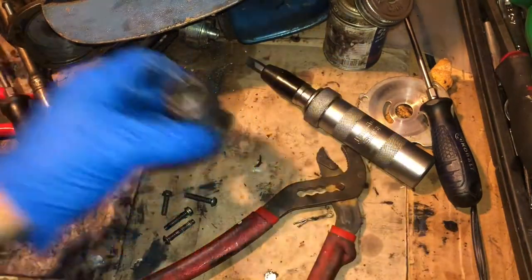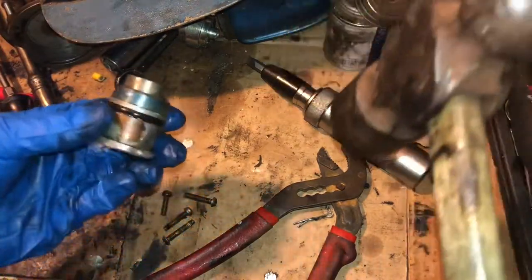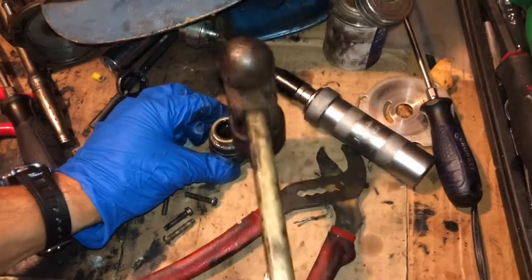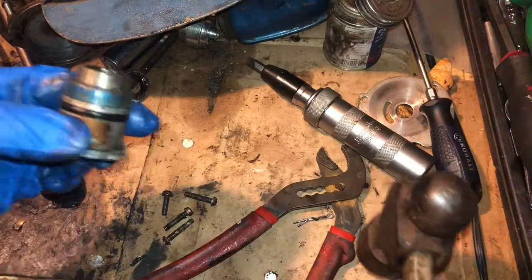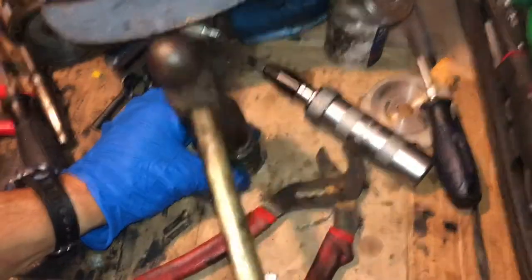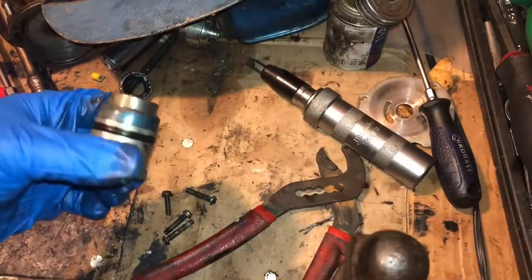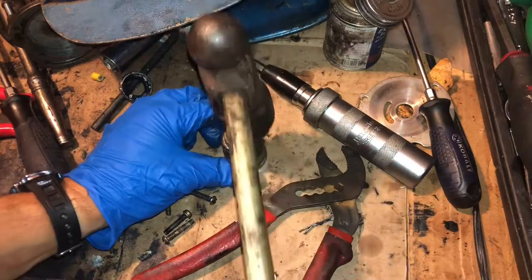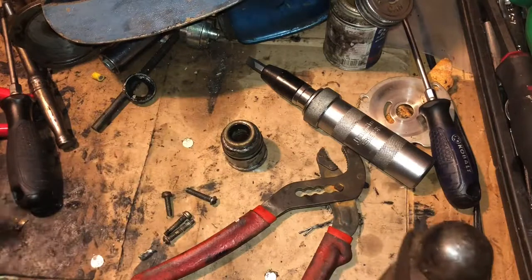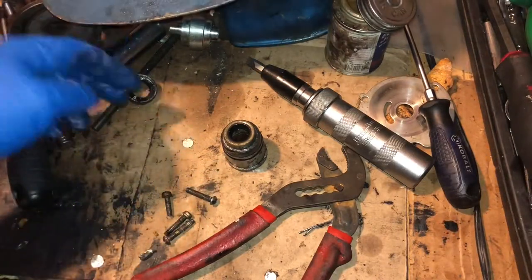Do the cup — hard to get in perfectly. One side is out a little bit more, so I'm just tapping on that side. I can see it getting straighter — tapping on the other side. Okay, that's better. Once it's pretty straight you can give it a proper whack.